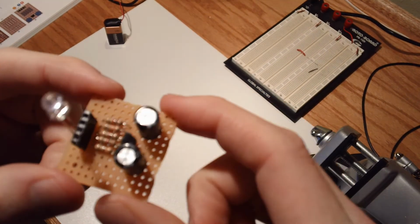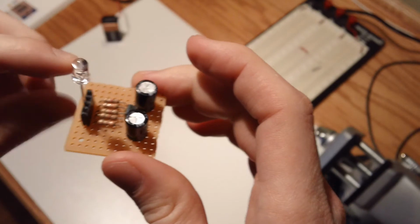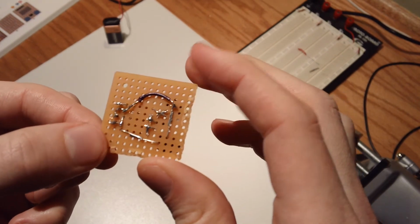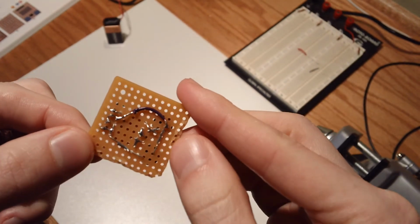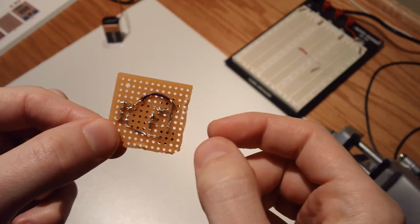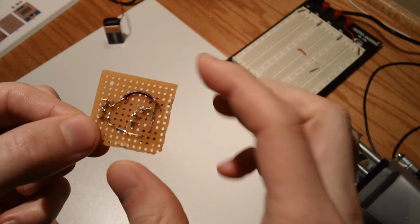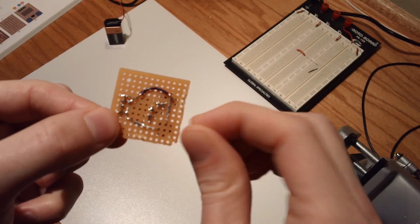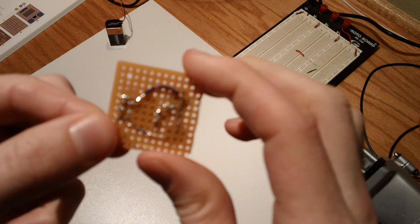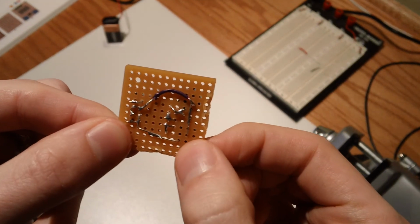I did. Oh, in terms of time, how long it took me to do this, counting cutting the perf board and mounting the components and getting confused when I'm looking at them upside down and soldering and the couple of mistakes I made along the way and corrected, this took like 2.5 hours. And I think once I get to the perf board where it's actually copper spots or maybe traces, depending on what I'm working on, that'll be a lot easier, because trying to connect the actual lead ends to each other is a lot more complicated than just soldering a lead end to the copper trace and then using that as a place to create common bus lines and things like that. So if I had a choice and I could do this over again, I would probably not choose to do this on a board like this. But c'est la vie.